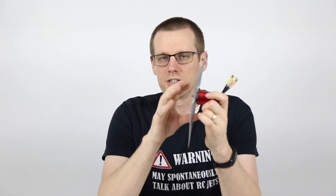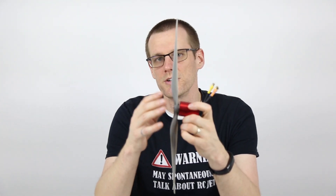With a full load, current goes up significantly. Let's say a specific load pulls about 10 to 15 amps of current. Then if we want more power, better thrust, or faster speeds, we change to a bigger load — a bigger propeller on our motor — and we're now jumping up to about 30 to 40 amps. These values are for illustration purposes. With a bigger propeller representing more load placed on this motor, we would expect higher current, which we definitely get. Step it up to the next available propeller and current jumps again. With one of the largest propellers, we'd pull even more significant amounts of current.